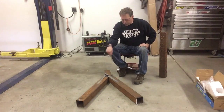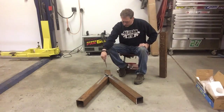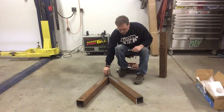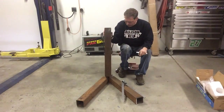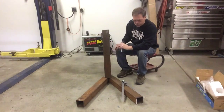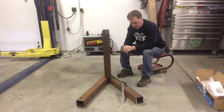I'm going to make a three-legged post — one leg in the back and two on each of the fronts. I'll cut and miter it all so I can set the other post right off the top center and mount my tool up there. I can weld some pins on it and clean up the rust. It's just some square tubing from a project a couple of years ago.